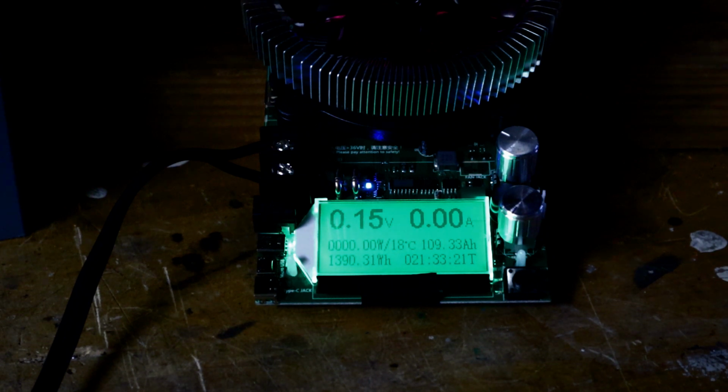Now, why would that be? That's simply because when Battleborn puts together the cells inside their batteries, they measure the individual cell capacities, and they arrange their batteries so that they will have somewhere between 104 and 108 amp hours of capacity. That way they overbuild to make sure that the customer is getting 100 amp hours. So the other thing to note is not just how many amp hours, but how many amp hours where the voltage is maintained above 12 volts.